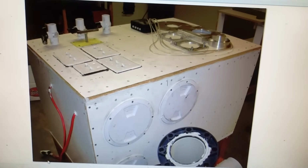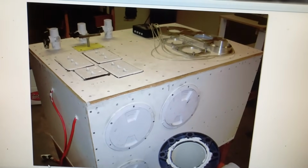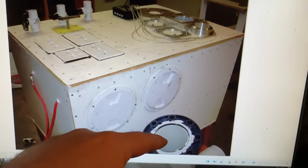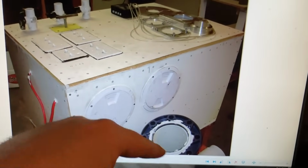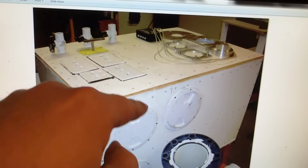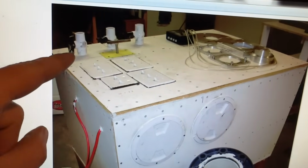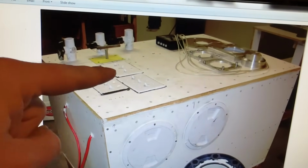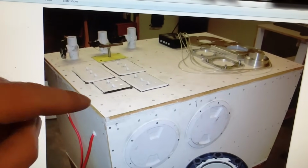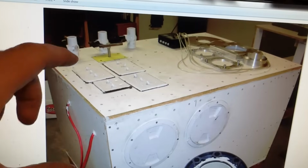So I was using most of the power of the entire house to fire it, because inside is that 3-car garage. The way it works, this is just a vacuum box, which hooked up to this plastic tube. They went through and then had an orifice, and then the black box read the pressure difference between the two, and then you hooked up the head further upstream. But anyway, I would kick on all three at once, and these valves here were check valves, so I'd leave them open when I turned it on, and I'd close them to get it right to 28 inches.